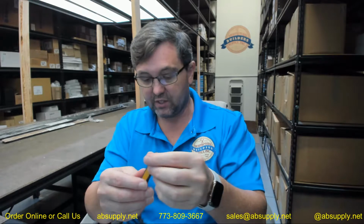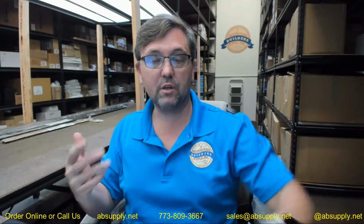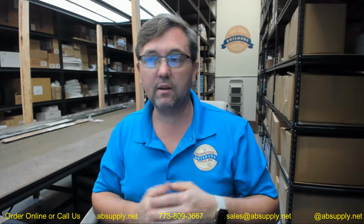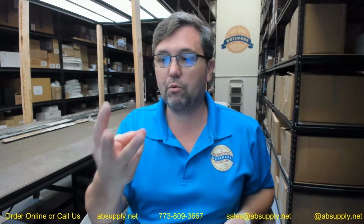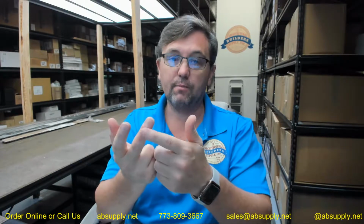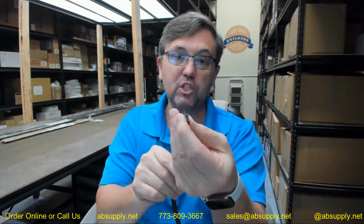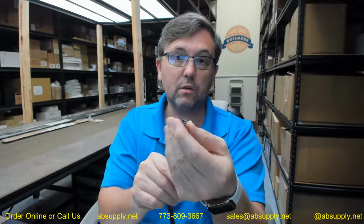And excellent compression. Door latches easily. That's advantageous because you're not going to see this material behave in such a way so as to prevent the code required compliant operation of a door. Meaning, if you have a fire rated door, you've got 3 rules. The 2 big ones everyone's heard of. You have to be self-closing, you have to be self-latching, and you have to be free swinging. The self-latching is where this comes in. It's not going to put up much of a fight to your door closer that's already installed. And in fact, you probably won't even know that it's there.